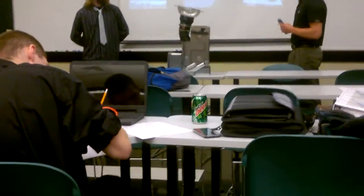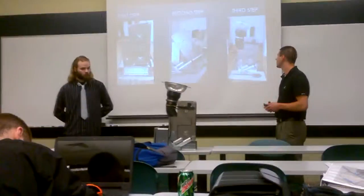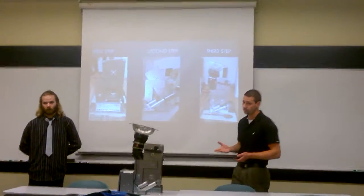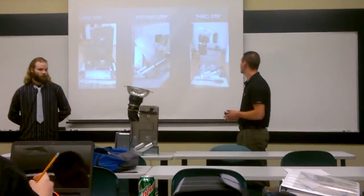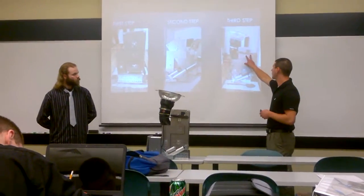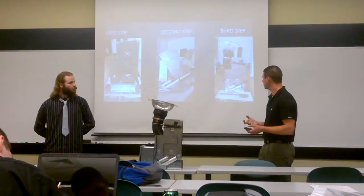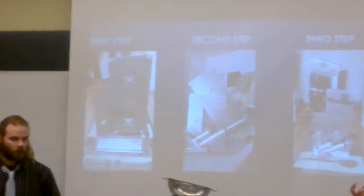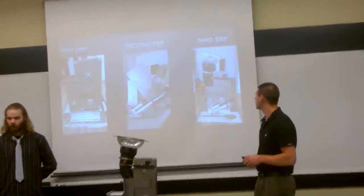The last step we took was to bring up a chute mechanism to feed the ball into the wheel, so that you don't have to manually put your hands in there. That way when the dog comes and drops the ball off, it's not going to get caught in the spinning wheels. We have a door actuator here — a solenoid — up to a chute mechanism. It's just a steel rod, and it will actually pull, close, and release the ball when the sensor here recognizes it.